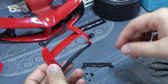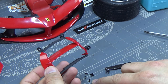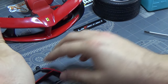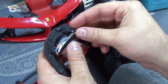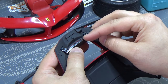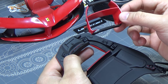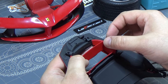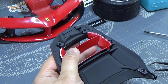Stage six: we're installing some bonnet details - the bonnet airfoil and the bonnet vent frame. We're going to need four D screws. This vent frame has a carbon fiber finish which looks beautiful. We set it right inside the bottom of the bonnet, then we take the vent frame and set it over top so it lines up with all the holes. We're screwing into die-cast so we'll use 3-in-1 oil.